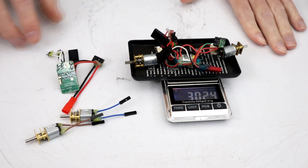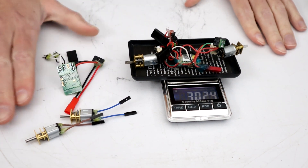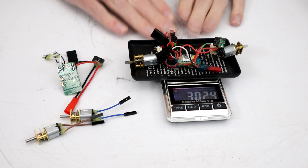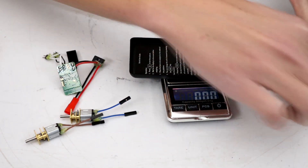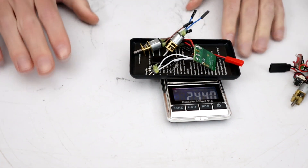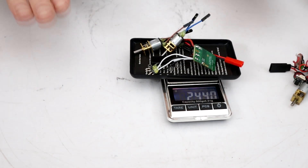We are all wired up. I've also added some hot glue to all of the joints, just to make sure that things don't fatigue and don't short out. We already have our old wiring system on the scale — it's 30 grams. Let's see how much weight we've saved by moving over to the Malinki and these really fast N10s. That's 24 grams, which means we have saved 6 grams. Now, that may not sound like a lot, but in a robot that is only 150 grams to begin with, 6 grams is a lot of weight to play with. That means not only are we going to be faster with this new electronic setup, I can also put more effort and more weight into the armor package, and hopefully have a chassis survive an entire event. That would be really, really nice.